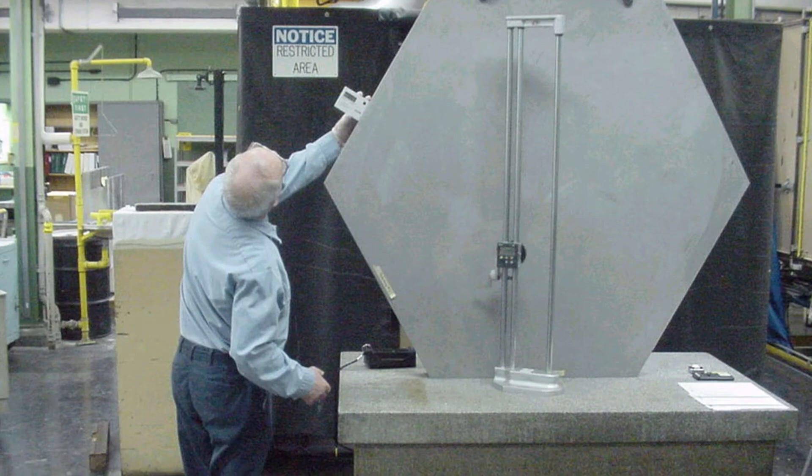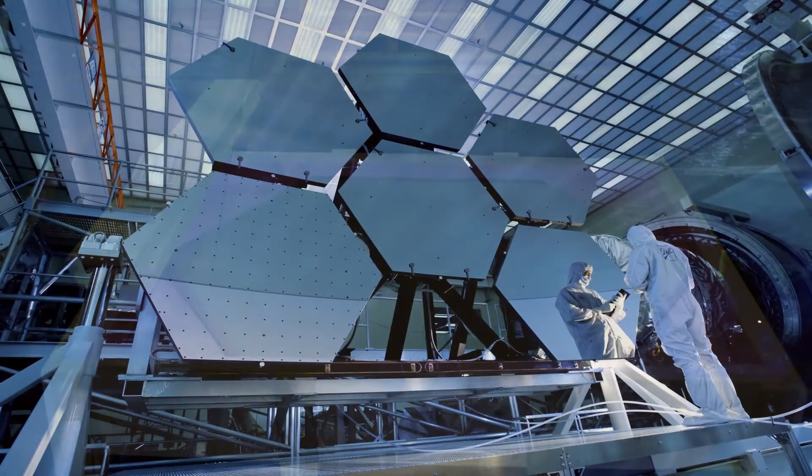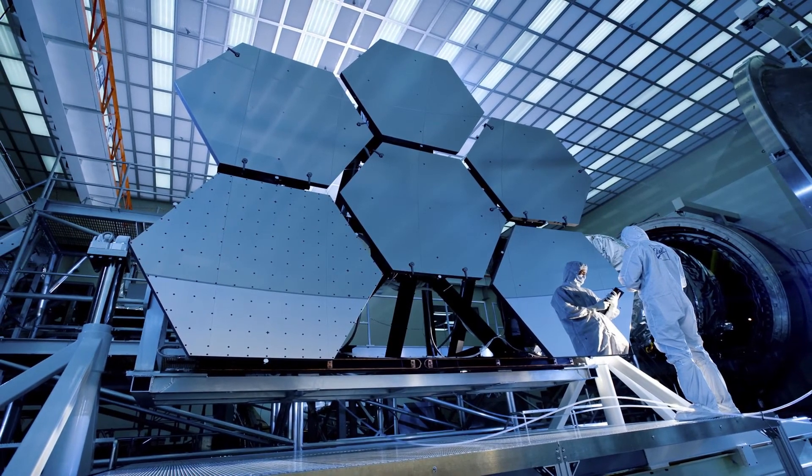We machine it. After it got machined, it would come to the saw and then we split it into two blanks. Beryllium is transparent to x-ray, so we would x-ray it to make sure that there's no indications in it. We prep it and we ship it to a finished machine shop in Alabama, where they started the finished processing.